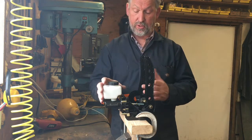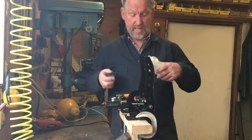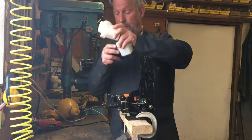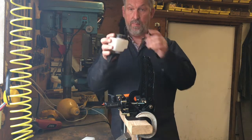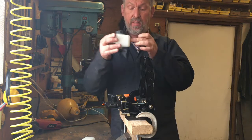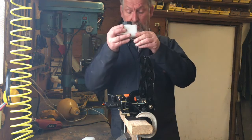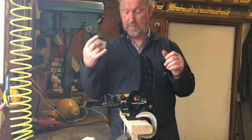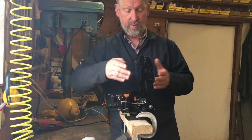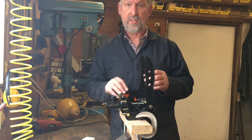You can either mount the master cylinders here on top — either a small one or a bigger one — or you can take a remote mount with an adapter and mount the reservoir up higher somewhere and run a hose down to here if you don't have space to mount the cylinders directly. I think the smaller one's going to be big enough since I just have single-caliper setups front and back. There are two rails underneath to mount this to, and I might add an extra brace to the frame for the brake pedal to get a really solid feel.